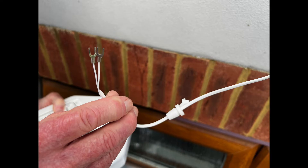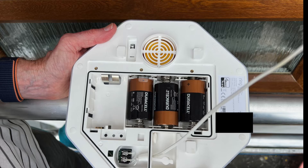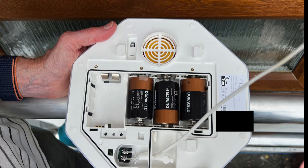It was impossible to record any video in the loft, but I managed to clear the insulation away from the hole and find the other end of the rod. Once that was done it was pretty easy to pull the cable back out through the hole — the plug end was in the loft and the cable came out to the outside where the actual siren will be. From there I took out the little grommets from the back of the alarm system and fed the cable through them, then fed the cable and grommets back into the alarm and wired it up.